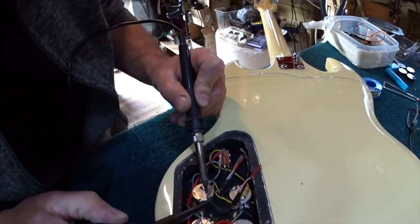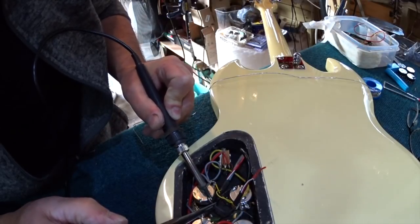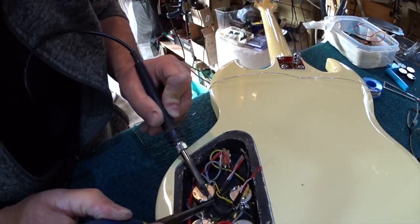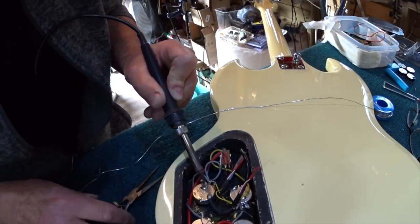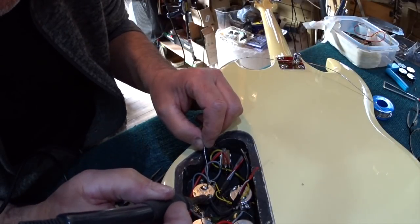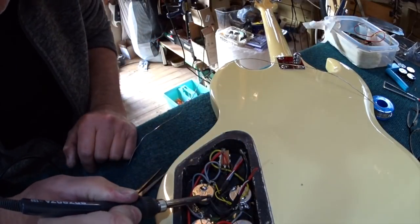Now, this is really difficult, to get this soldering iron to transfer enough heat to melt this blob. And while you're doing it, of course, you have to be very careful not to end up roasting any other part of the thing. So, I can maybe get that on there, but boy, does that not want to do anything. I'll try and get some added solder on there, and the only reason I do that, not because it needs any more, is because it's about the only way I can help transfer the heat across required to get this stuck down properly.